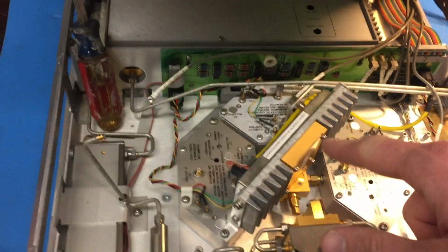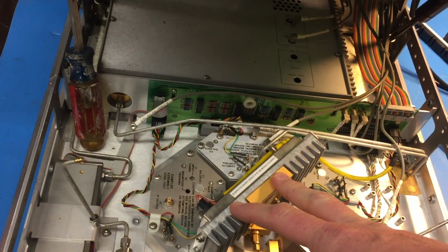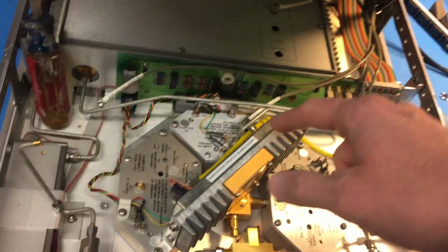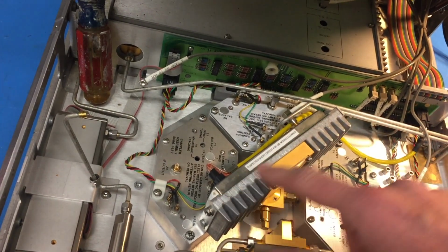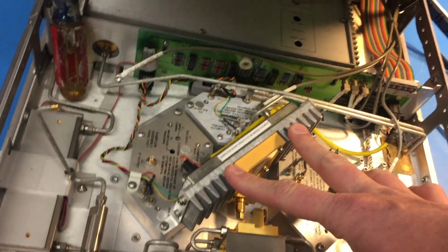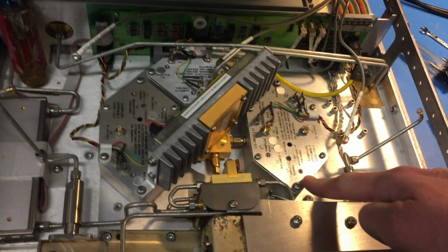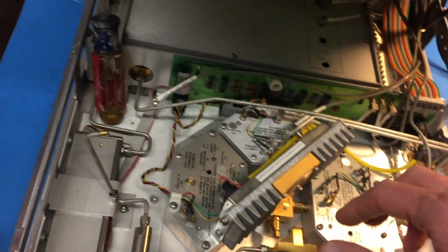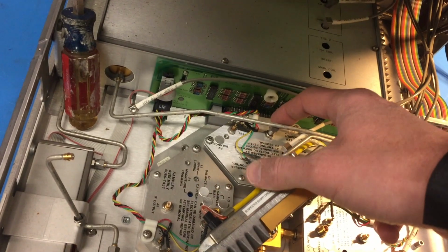I'm pretty sure it's a phase lock problem, because this thing working by itself doesn't kill the power supply, but when it's in the PLL, this has a step recovery diode, and it's actually part of the PLL system. It generates harmonics, and then these down convert at an offset frequency of 4 kilohertz. It's a long story. But the PLL is locked through this thing.